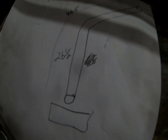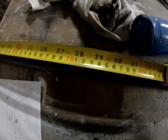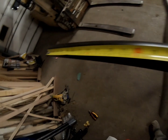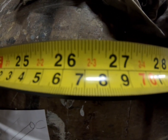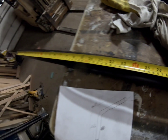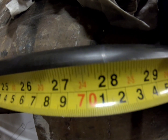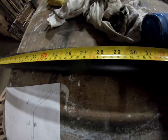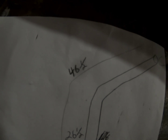First things first, I'm going to mark up my pipe and cut it. I've got 26 and a half inches, so I'm going to add an inch and a half which is 28, and cut it there so I don't cut it too short. My bend starts at 26 and a half inches up — if I bend there and make a little mistake my pipe is too short, so adding an inch and a half buffer at 28 is safer. My total length is 46 and a half following the pipe, so I'll measure that up and cut it. That's my only cut for now until I bend it.